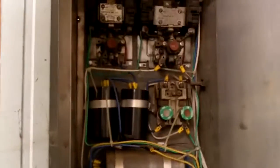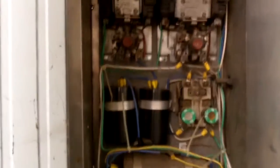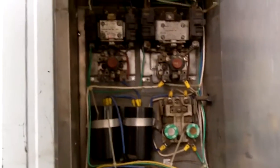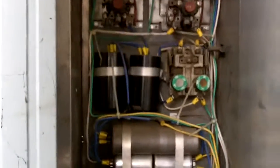Back here is my homemade three-phase converter. I got the idea from somebody on the internet, but I had to change the way it worked because the wiring wouldn't work for mine. It's better to build a rotary phase converter out of an old three-phase motor, but that's what I had so that's what I used.